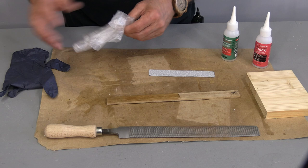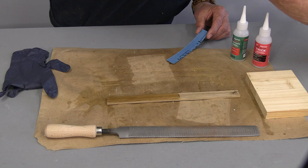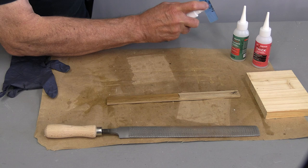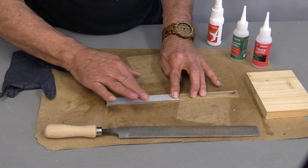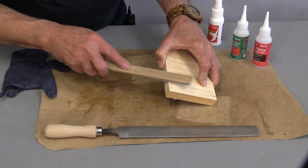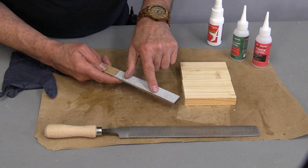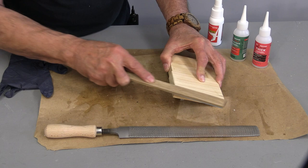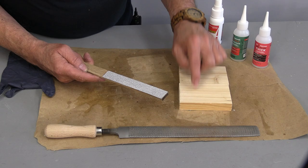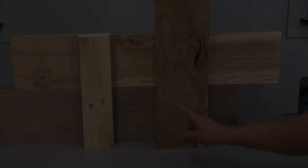I can take that glove off, and on the back of the sandpaper I'm going to spritz the back of the sandpaper with accelerator. Now I can take that and lay it on there carefully, lining it up. That is solid on there already — you can use it right away and put as much pressure on it as you want. That sandpaper will stay on there until it absolutely wears out. All this is is a scrap piece of wood you probably have laying around your shop, and you can make your own handy rasps at whatever grit you want.